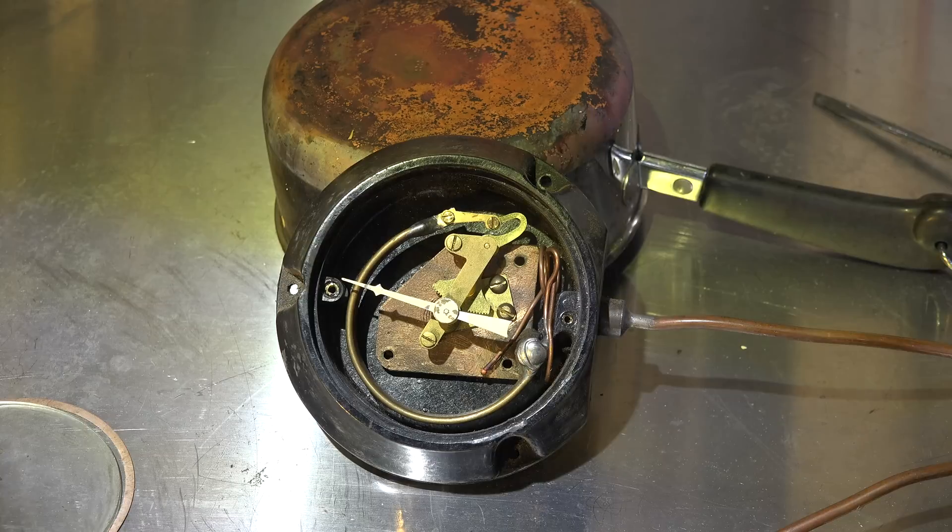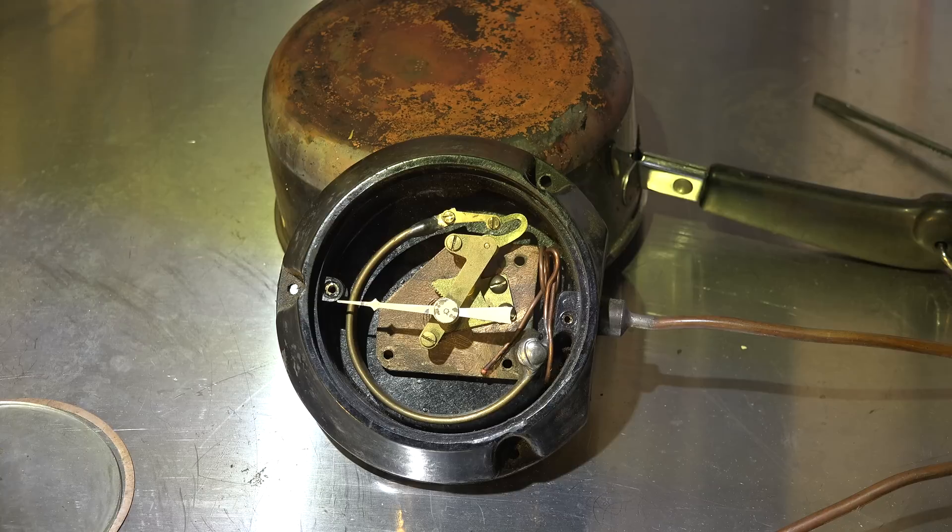It's a great demonstration of the temperature-pressure relationship of the saturated mix — that's what this whole thing is about. That's what the old style thermometers used. This is how you can use a saturated mix in an enclosed tube to tell what the temperature is in a structure or any kind of medium you're working with.